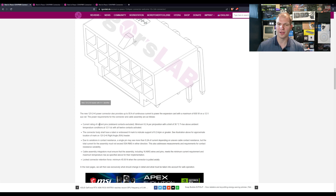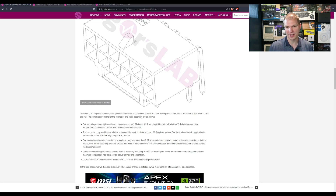They were keeping compatibility, which I like to see — especially with these connectors, you'd hate to have a whole different connector. He notes it's 55 amps of continuous power. If I remember correctly, it can only get 30 degrees Celsius above ambient, and the sense pins have more of a safety mechanism to them. We are making progress: the connector has to have a retention force of 45 newtons when pulled axially, so you need a good amount of force now.